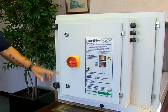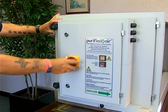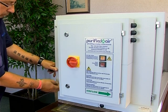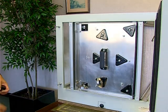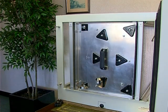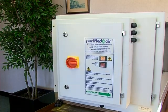The door to the filter components is hinged and secured by two compression locks. To open this door and access the internal components, double check that the unit is isolated electrically and then simply unscrew the star knobs. In the event that the unit is not isolated, there is a micro switch which will cut off the power once the door is opened. Please make sure that a period of 10 seconds is observed before touching any components to ensure any static voltage is dissipated.